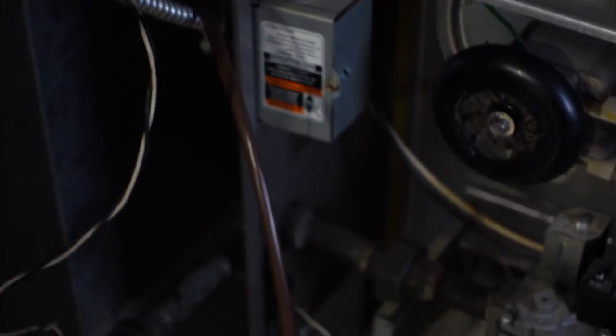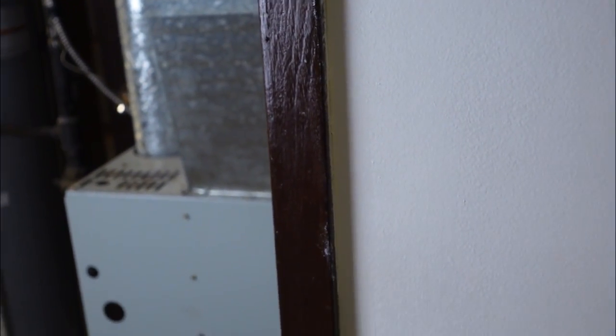You're probably wondering, how are you going to install this without running the wires upstairs? I'm actually going to be installing the thermostat downstairs, and yes, we're going to account for the shift in temperatures. The next portion is running the wire to the new thermostat, which I'm going to install right on this wall on the other side of my furnace. I suggest picking somewhere that doesn't have a hot air vent. My vents are in the corner, so this wall works perfectly. I'm going to drill a hole through here to fit the new wiring and then mount the Ecobee.